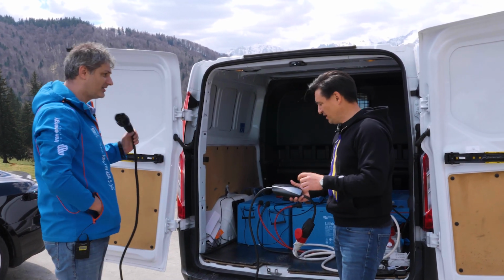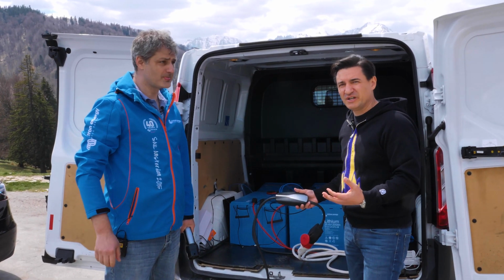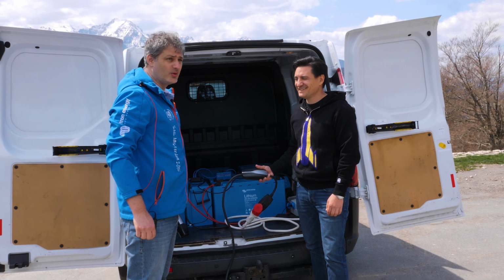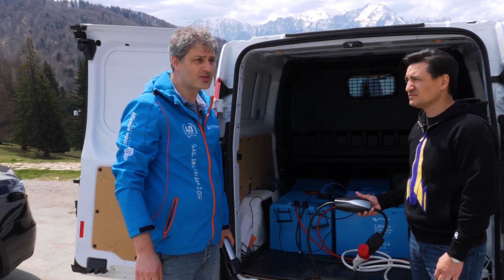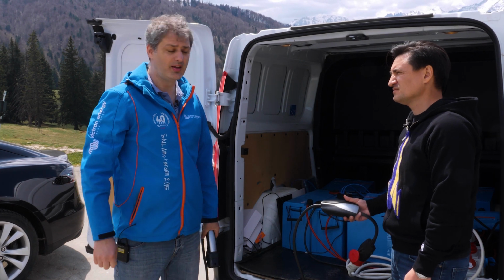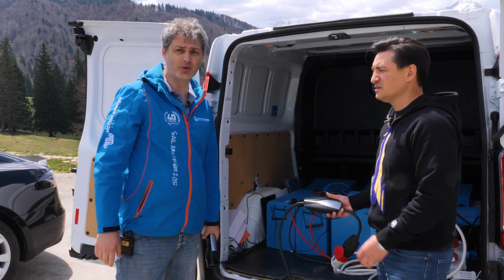That's important. Whenever you see red on a Tesla charger or on a wall connector, that's bad news. You cannot charge. And that's basically the problem with generators and battery packs when you don't know what you're doing. Yeah, we have something special inside our inverters. It's called a ground relay. You can configure the inverters to connect the ground with the neutral. And this is why this charger is working here completely off-grid with a missing ground.